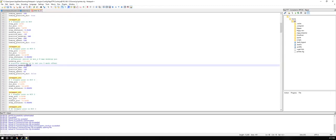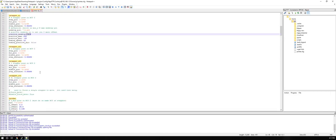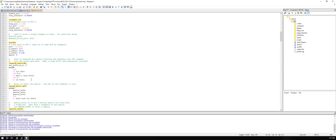You're going to need to move your head over to this position. You have to have your XY fixed up first. You're going to need to do some homing override, which I already have set up in here. No matter where the head is at, as soon as you hit G28, it'll set the Z to 0. It's going to move to absolute mode. It's going to go up 15 millimeters in Z. That was why I had to do the Z0s there. And then it's going to do a home on X and Y.